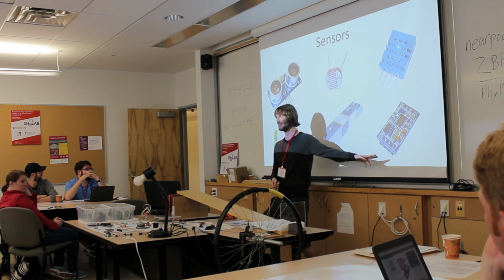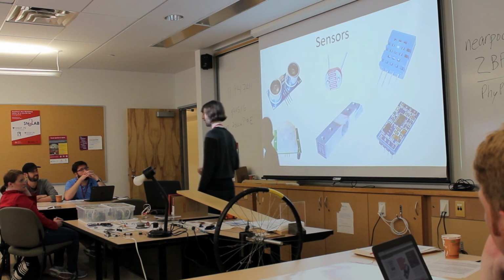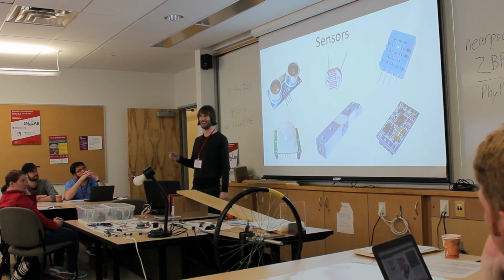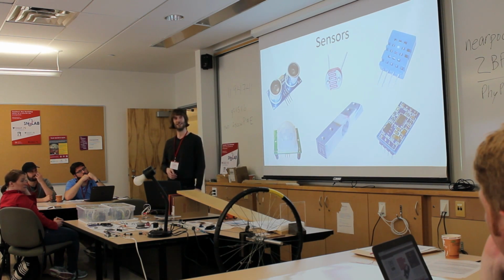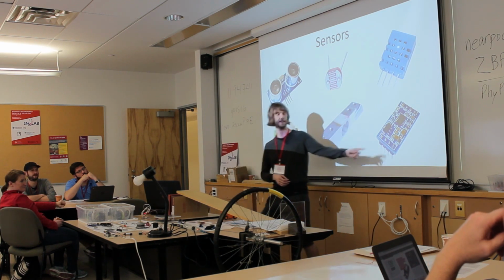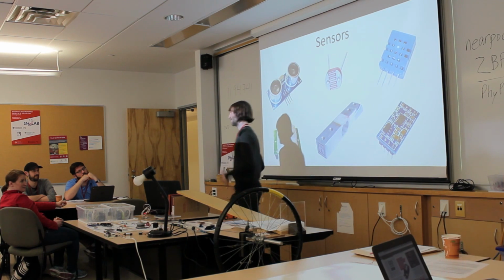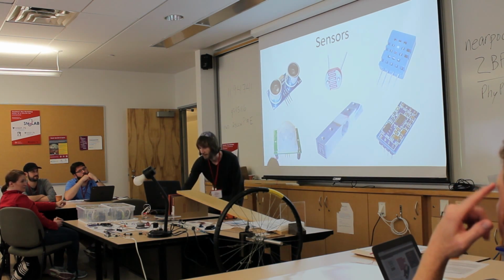And we have an accelerometer. So this is actually a 3-axis tilt accelerometer. You can put that on a robot or a demo. You can tilt X, Y, Z axis, and it'll plot it out. You get about 9,000 samples per second if you want, using an Arduino. And you can actually get very precise data readings. You can even calibrate these and go to other levels. And that costs about $3 as well. So this is the world I'm trying to bring to people. It's just inexpensive robotics.